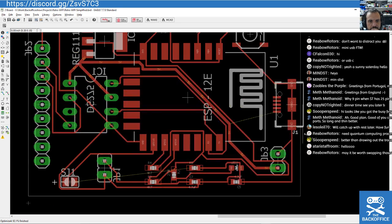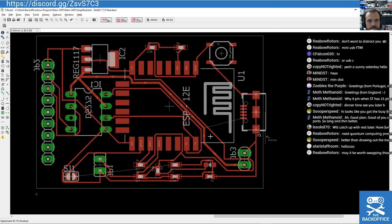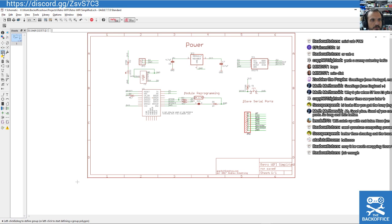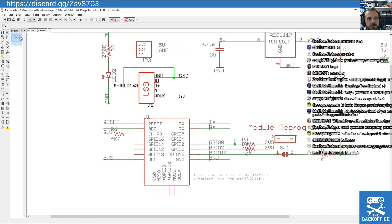Let's see how we can get that last couple of traces on it. Don't know, Jared, the resistors at the top don't seem to be giving us any grief at the moment. USB port though is. Yes, indeed. The only time you have all of these dual footprint things, it does cause problems. Okay, this is our simplified drawing at the end of the day, so let's just kill our USB port. We don't need that if we're doing a bit of testing, do we?